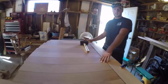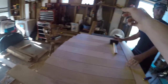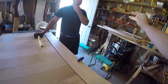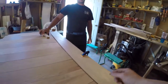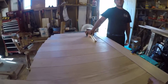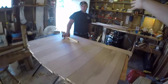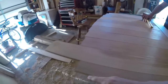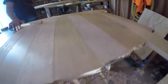We've marked that there are 25 inches of visible wood between the bottom rail and the top rail. The bottom rail groove was a little over half inch, and the top one was three quarters of an inch. We added that to the overall length of the boards, giving us 26 and a quarter inches. We made marks on each side, then took the arch curvature template and lined it up with those marks and drew a line all the way through.